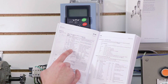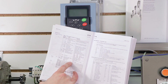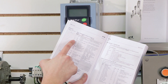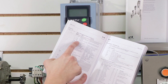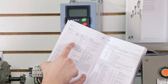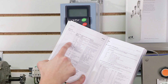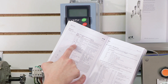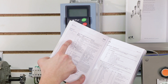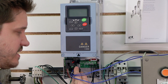So if you look at the manual it ships with a basic application setting for your macro. Now if you look at this macro you'll see a wiring diagram from terminal 6, which is our control voltage plus 24 volts. We need to switch terminal 6 to terminal 8, which is digital input 1 and our start forward. Then if we want to do start reverse, we need to switch terminal 9, which is digital input 2 for start reverse — and you'll notice these switches right here on the electrical diagram.